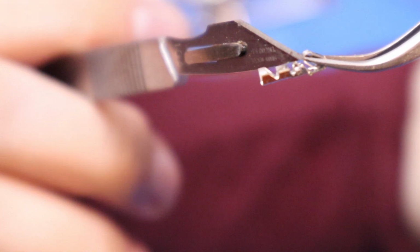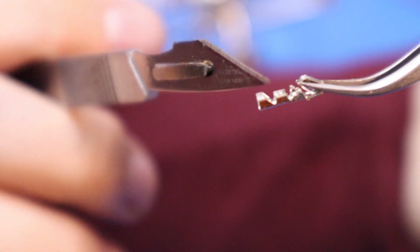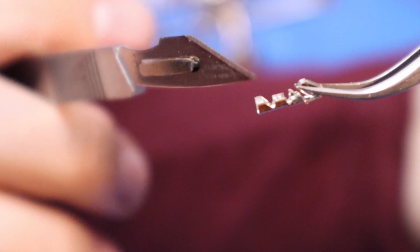This bit here, I don't have the right crimp tool for this, I'm using a really cheap version for it. But if you have the proper crimp tool, it actually grips the connector by wedging a little piece in there, and then you can push your wire in this direction, it butts up against that bit. This section in the middle crimps down on the wire, and this section on the outside crimps on the insulation to give it strain relief.